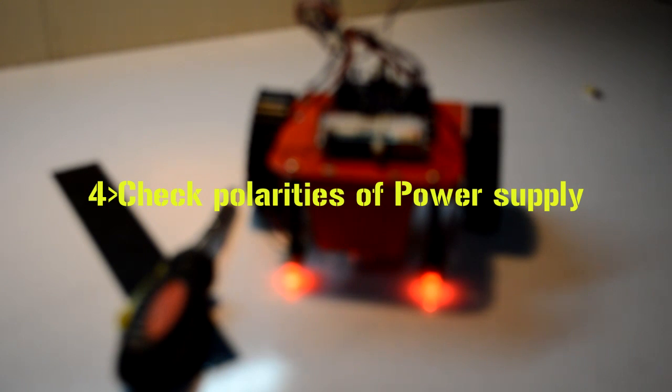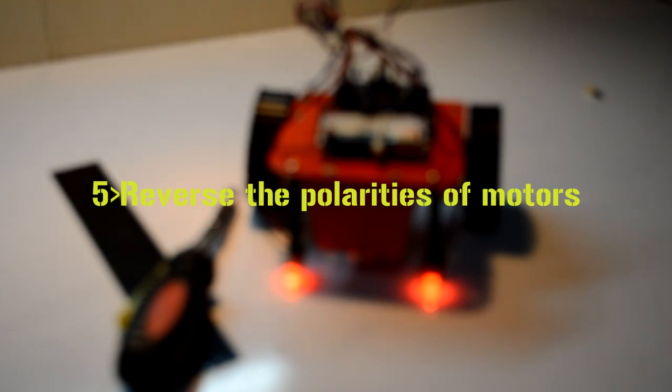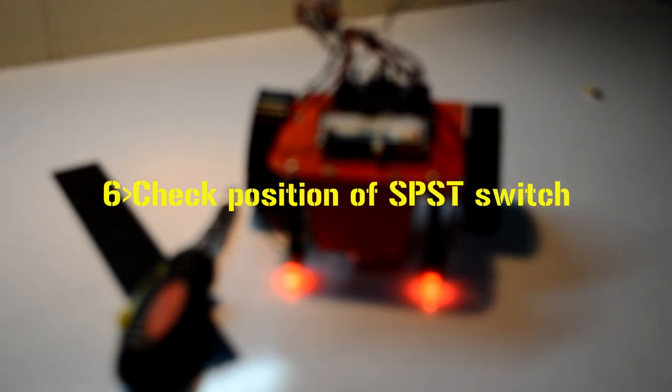Check if your power supply polarity is correct — you might sometimes exchange negative for positive or positive for negative. And if your motors are running in the opposite direction — say your left motor is moving forward and your right motor is moving backward — then the only thing you have to do is change the polarity of your right motor. After changing the polarity it will move from backward to forward. Also check the position of your SPST switch, which is the main switch that turns the board on. There are markings on the PCB that say on and off, and there are only two terminals which get shorted when the switch is activated. Make sure you have soldered the switch in the right way.